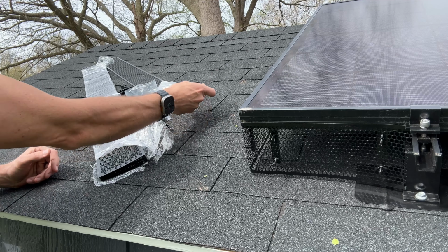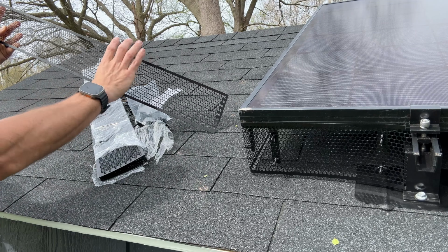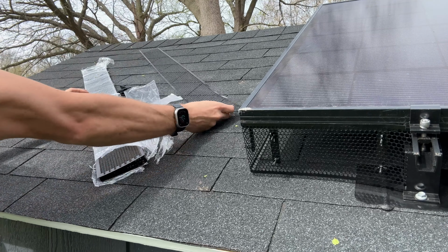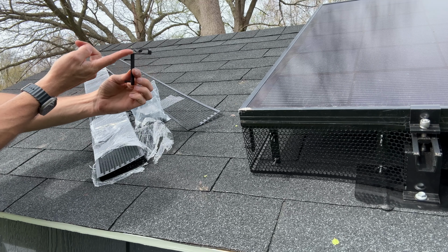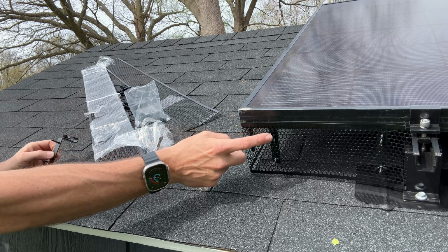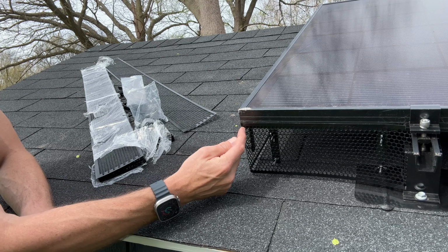So first up is going to be our higher end option. It comes in actual 4-foot lengths of a punched 5.5-inch sheet of galvanized steel with a PVC coating. It does have some rigidity to it, especially compared to our second option. And the way you attach it is with brackets that lip up underneath the frame of your solar panel. Then you have these 2 threaded studs coming out, which use wing nuts to tighten up. Now there's a link in the description for this exact one, but you can expect to be around $3 per linear foot.